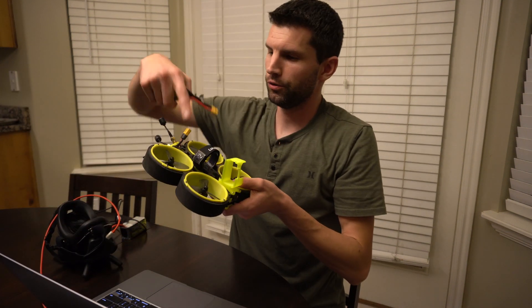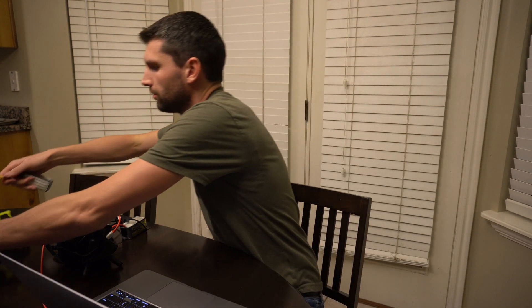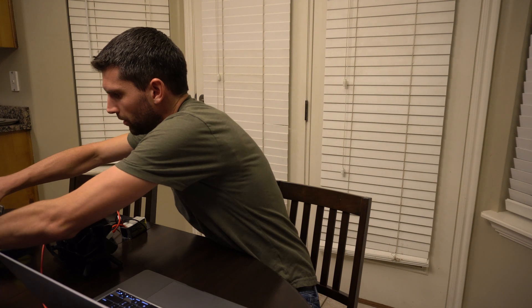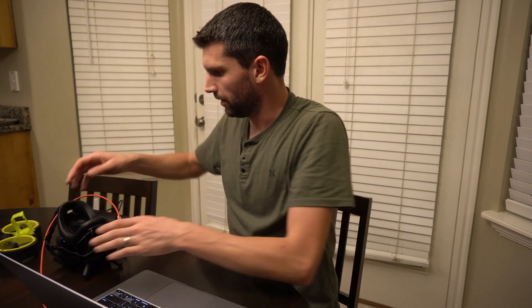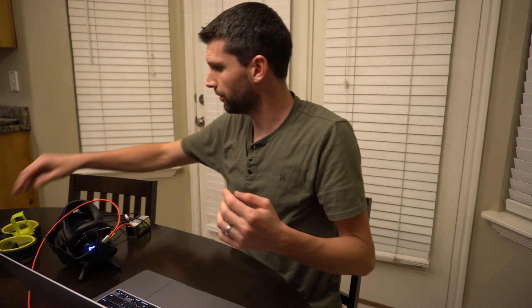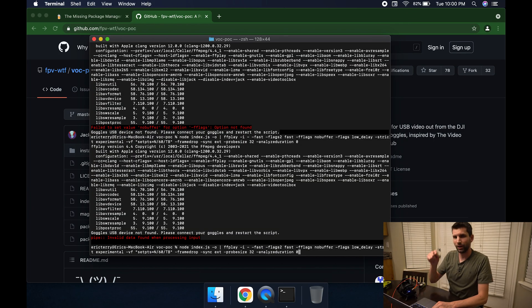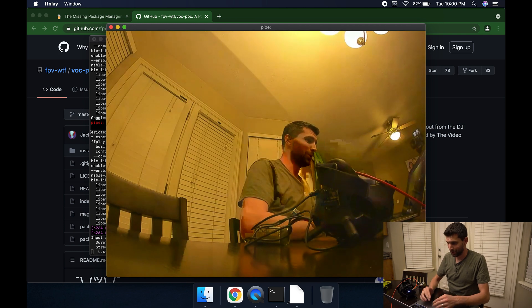Be sure you safely remove the props, then plug in your drone. Plug the USB-C cable from the goggles into the adapter and plug that directly into the Mac USB-C port. Give it a second for video to appear in the goggles. I can see video coming through, so I'm going to press the up arrow to bring up that command again and press Enter — and boom!